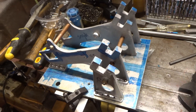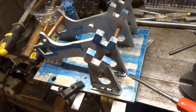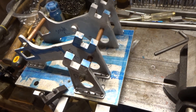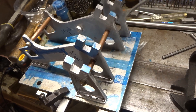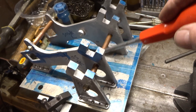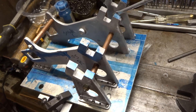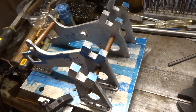I've got the side frames of this engine lined up and screwed to the base plate. The 4BA screws are temporary, but I've put two stiffening rods side to side with spacer tubes over those quarter-inch diameter rods to hopefully make a fairly rigid arrangement for the engine when it's erected.